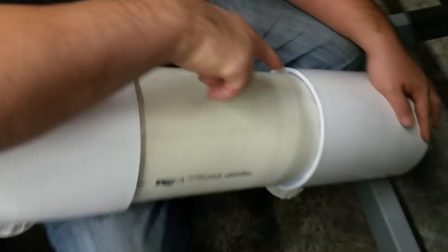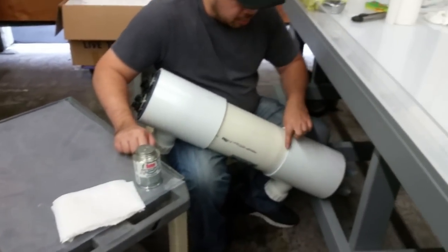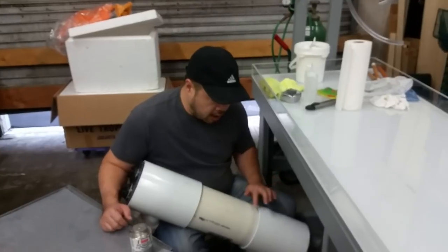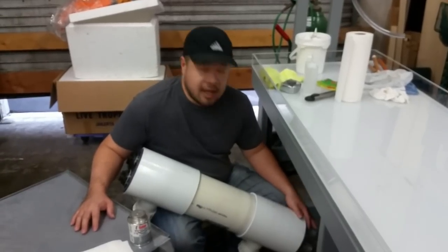Come in closer — see that crack right there? That little crack looks like a defect in the PVC pipe itself that was used to make this UV unit. What I'm going to do is try to seal it up. I took the UV out, cleaned up the whole rim all the way around, and now I bought some thicker PVC glue and I'm just going to put a bead around the whole thing to try to seal up the leak. I know this is not the most ideal way, but since it's a dripping leak and not really pressurized, it should hold.